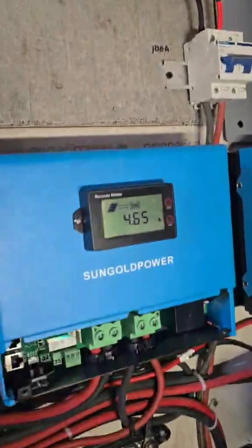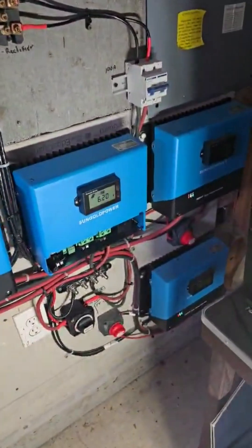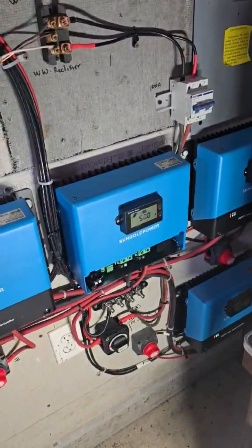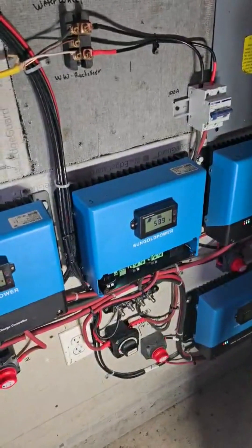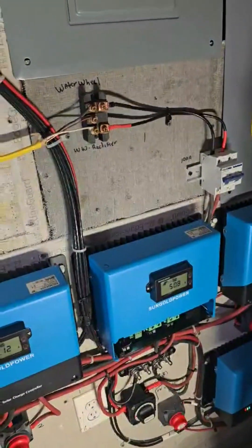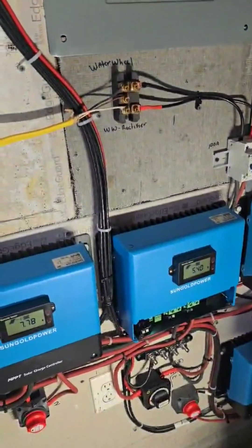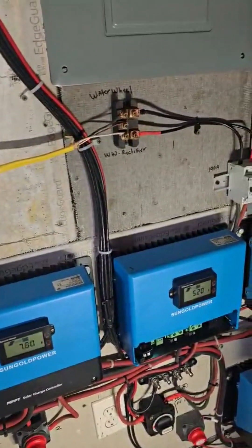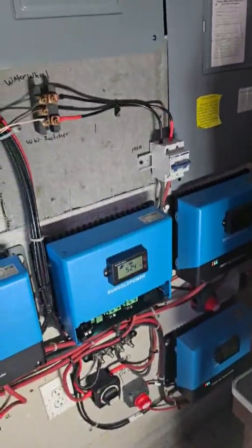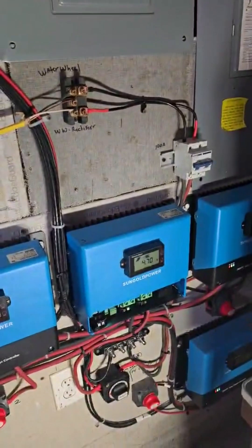My next move is to pull apart a washing machine motor, rewire it, and make a video on that too. The water wheel does have potential — you just need to find the right generator. People ask why I don't use a car alternator, but the 350-foot wire run would have to be very large gauge. Running three-phase up to the house and into a rectifier is the better solution. Next I'll dig a trench to pull in the bigger wire — right now it's 12-gauge temporary wiring, and at these low amperages I may not be losing that much. Anyway, thanks for watching.